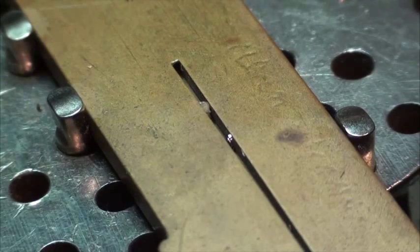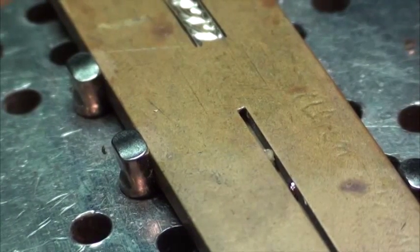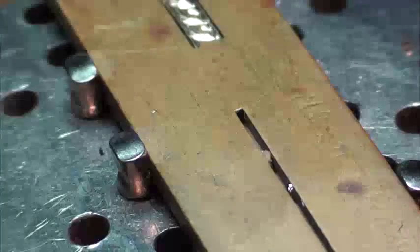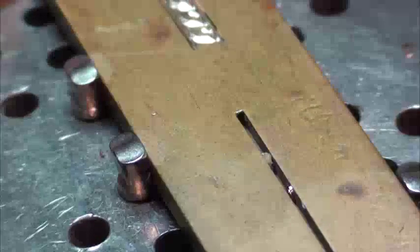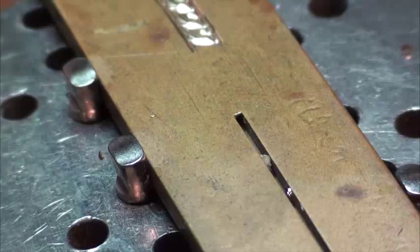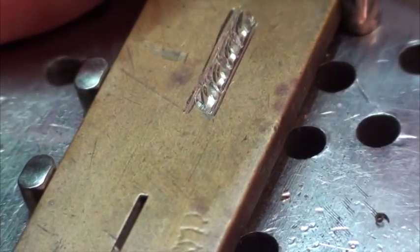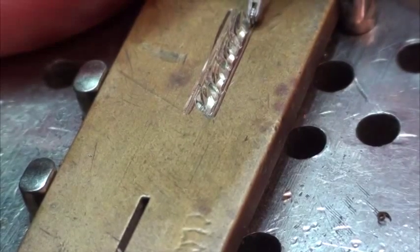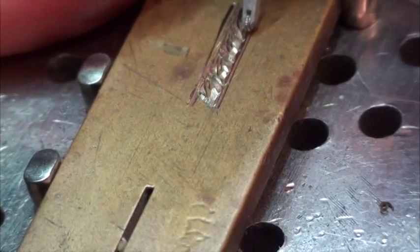So we then go over to our friend, which is living down here, there we go. So go to that guy. Come on, you bugger. And we use the oldest trick in the book to hide bad setting and bad engraving. We run a mill grain over it. Generally, if your setter's told you that he thinks that a mill grain looks better, it means he's stuffed up his bright cutting and you have nowhere to hide it. And you have a mill grain.